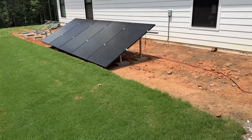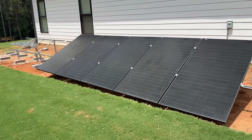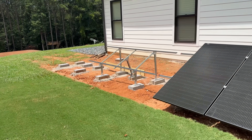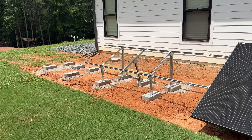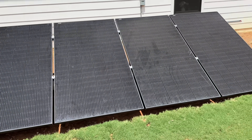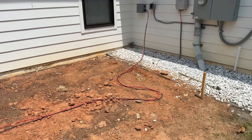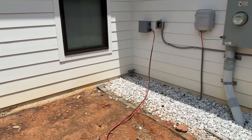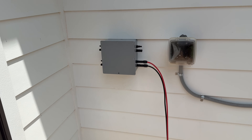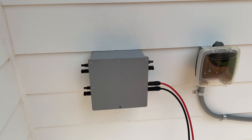The plan is to have 10 panels at 405 watts each. Five are already set, and I'll put another five on these ground mounts. Between those 10 panels, I'll split them four ways — three branches of two and one branch of four panels — going into the high-voltage side of the Delta Pro Ultra. I also have the same type of PVC junction box on the outside to pass the MC4 connectors through to the inside.